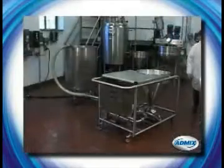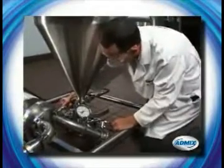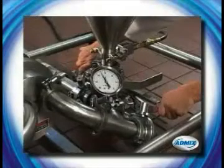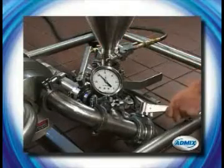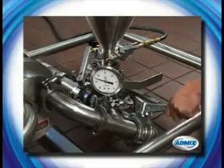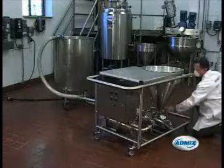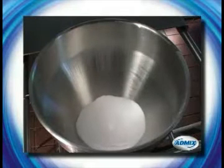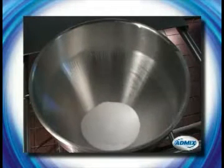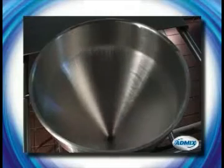With the specially designed suction pump energized, liquid flow is easily adjusted with valve A to a rate of 10 to 90 GPM. The vacuum level is adjusted to the desired level with valve B, and the powder discharge valve below the hopper is open for powder addition. This provides the proper ratio of powder and liquid flows, ensuring the correct solids concentration as the slurry enters the inline Dynashear disperser.